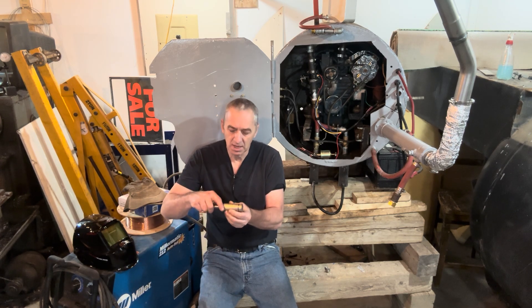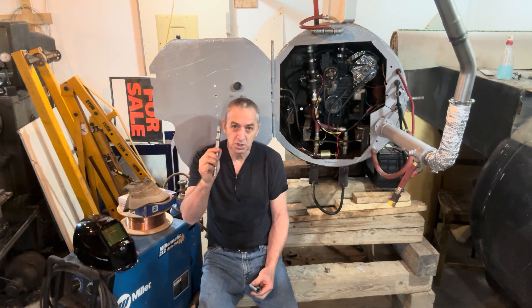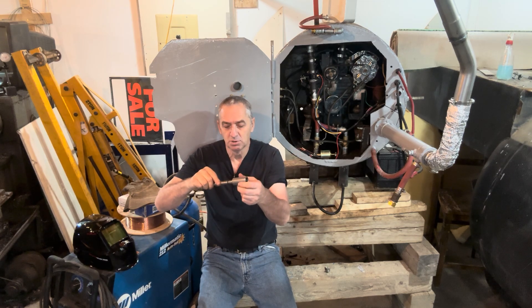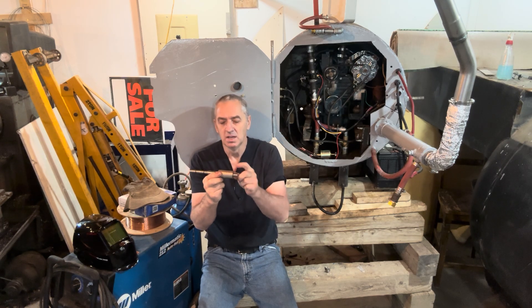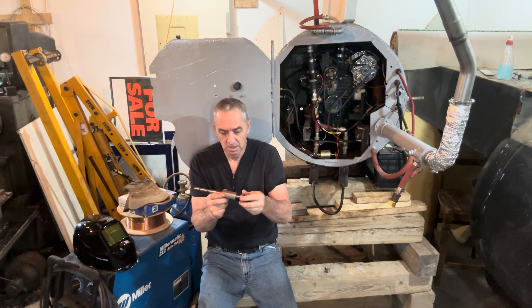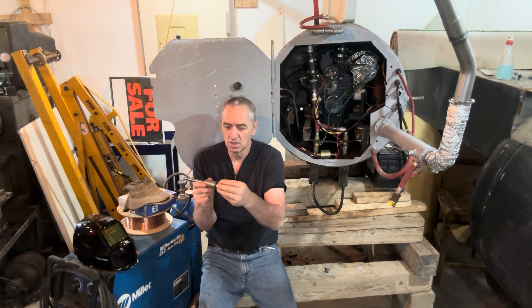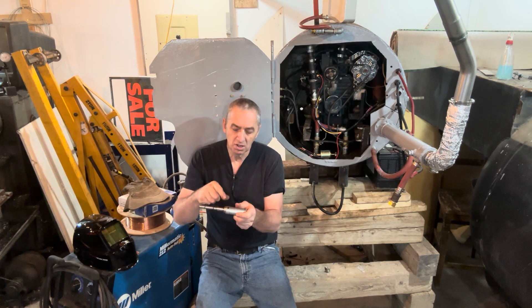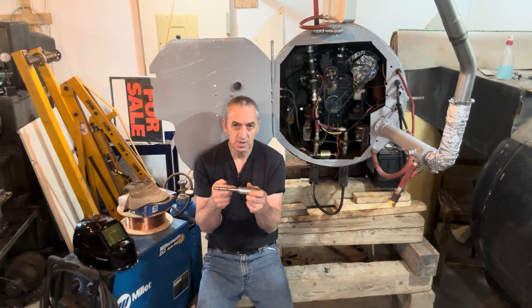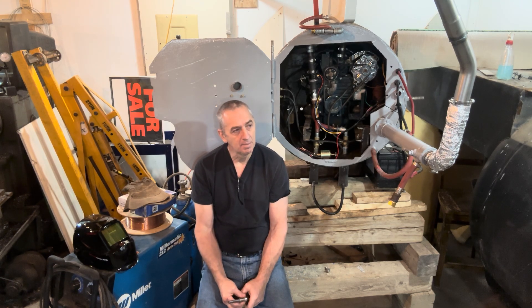What this is, is a stainless steel shaft with two o-rings machined on it. This housing — bushing, we'll call it — gets welded into the hull. I drill a hole in the hull and weld this piece in. This end piece will have a handle on it with a set screw, so that will rotate the shaft. This little collar has a locking set screw that stops the shaft from trying to move in and out. This is to turn on the valve for the exhaust.